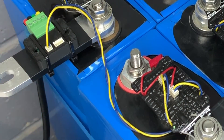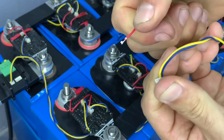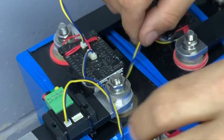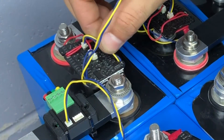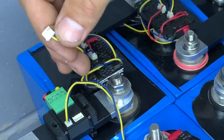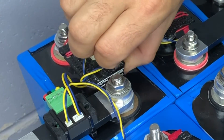We're just adjusting the cables to make sure everything is nice and tight and tidy. For the very first cell we connect the two-pin into cell one. We then pull out the red wire, because leaving it loosely about is prone to cause problems. We pull it out of the four-pin altogether and plug it into the four-pin of the CMU. You can leave it in, but it is far better to eventually take it out so it's nice and tidy.